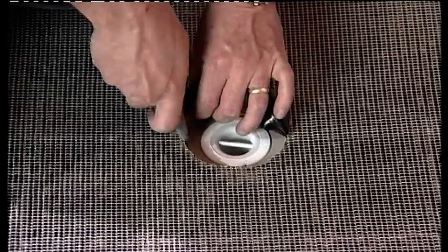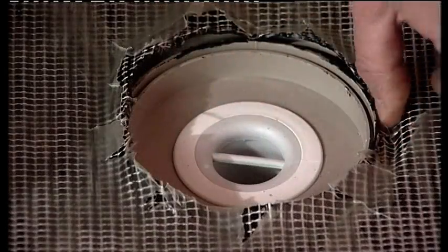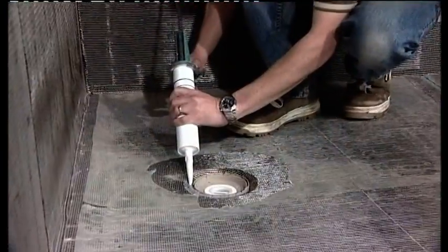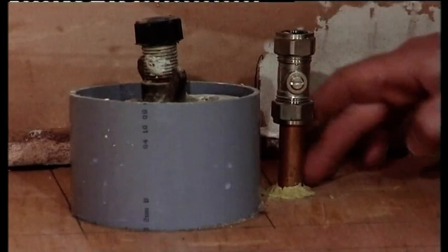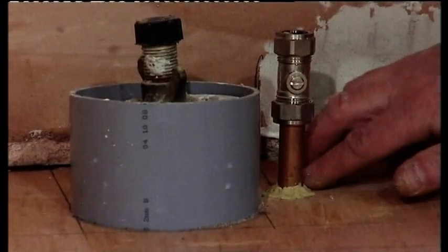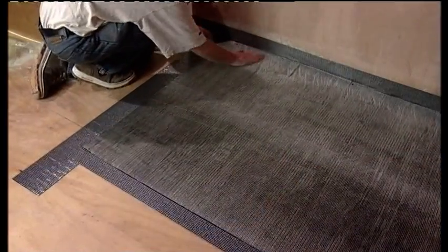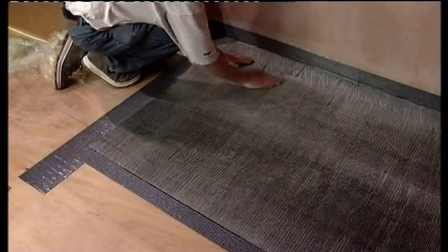The next stage is to cut out the hole for the waste. Cut across the Tile Safe with a sharp knife and then cut a circle using the knife's edge around the base of the trap. Once this has been removed, the Tile Safe needs to be dressed into the circular channel of the trap, and the trap fittings can then be fitted accordingly. The joint compound provided is now applied to all corners and joints around the gully. If you have any pipework that penetrates the membrane, you will need to seal around the pipe using the putty provided. Should any minor damage occur to the Tile Safe membrane during installation, it can be rectified using the repair putty supplied.